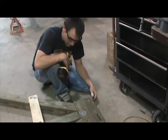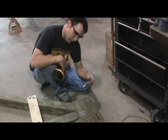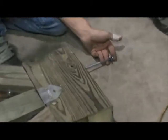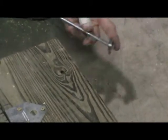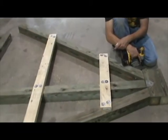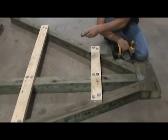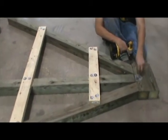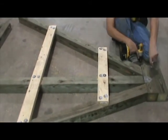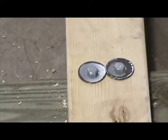That's actually what we're finishing up right now. We've drilled guide holes through both of these, and we're throwing in six-inch lag screws with big washers on top via an impact wrench just to make sure everything's safe. As you can see here, this is what one of our final A-frames looks like when it's complete. We've got anchors on both ends — the anchors on the vertical end on the bottom are already on the base. We've got two-by-fours across the four-by-four triangle with the vertical just to make sure everything's safe and sound because our counterweight is going to be heavy.